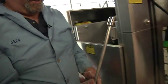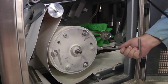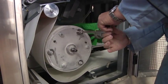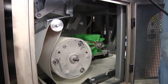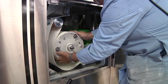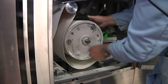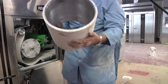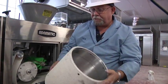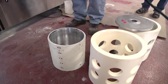To take this drum off, the three nuts with the large washers are the ones that come off. Pull the drum out a little to loosen them, then remove the three washers. The inner drum can then come off and be taken to the sink and washed. No hot water on this piece because it's not only riveted but also glued — hot water will loosen the glue and the cover will come off.